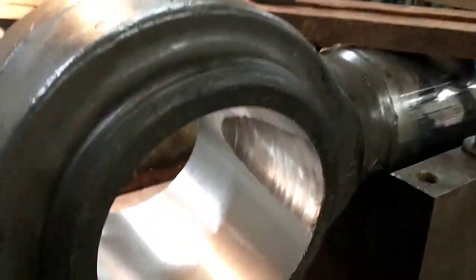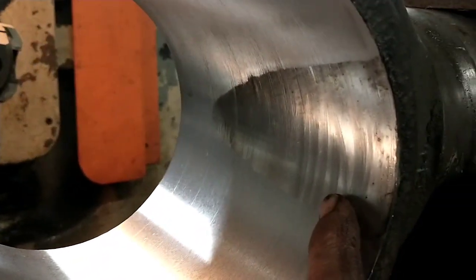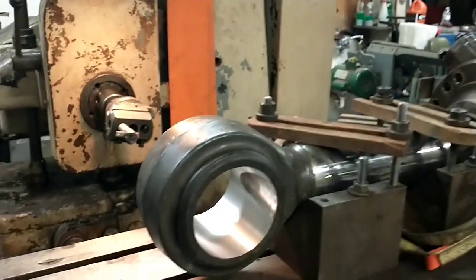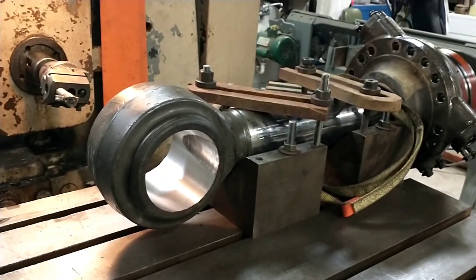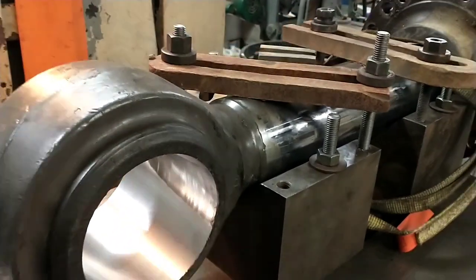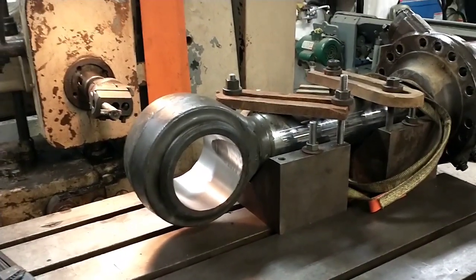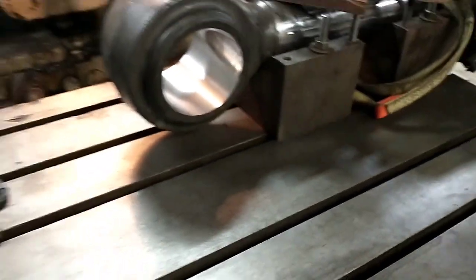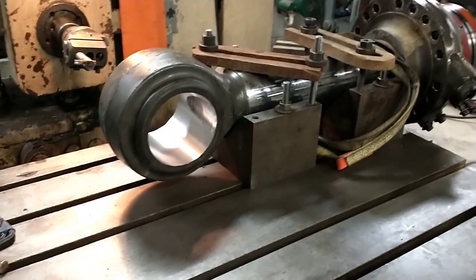I'm cut oversize now. You can see it left behind an uncleaned section - the wear was more on this side than the other edge, but that's not life and death; it's not a huge cavity. I'm putting enough weld buildup in one pass that it should fill that in. If I'm getting down to my finished passes and that section isn't cleaning up, I'll have to hand weld in there a little bit. We're going to go ahead and run welding it at this stage because it's 50 over on a side, which is what I'm after. I'm getting ready to put down some sheet metal on my table so I don't arc my table all to bits, then set up the bore welder and see what we can do.